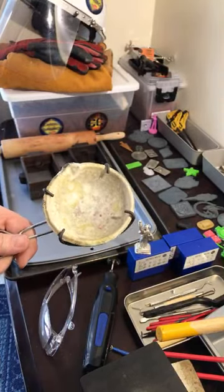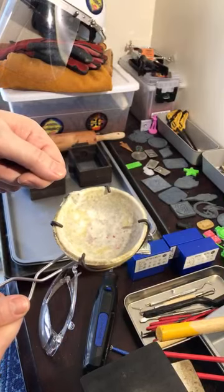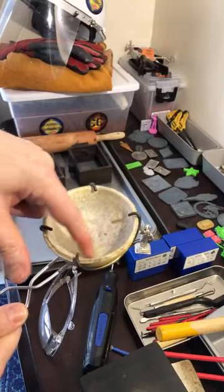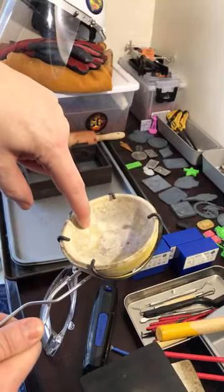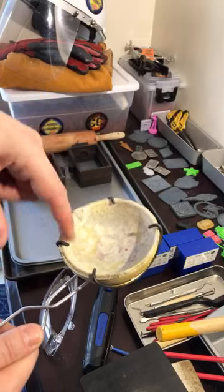But whenever you're melting, you got a torch on it. You got to start moving it around, and it'll get kind of glowing red all where you're moving it. And then you want to get it red up in here before you pour it. Otherwise, it just wants to stick to it. You got to make sure it flows good.